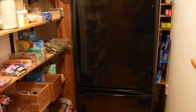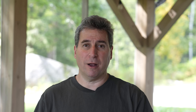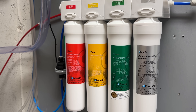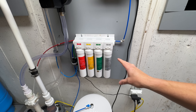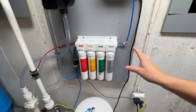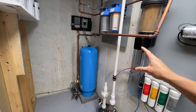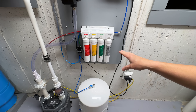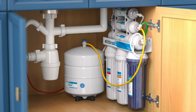But in my case I've got a bigger benefit — I've got two different refrigerators, each with an ice maker, and one with a water dispenser too. If I was buying those manufacturer filters, I'd be spending about $250 every single year for poorly filtered water. Now I've got one system plumbed into both units and I'm getting better filtered water delivered to both. The filter system itself is this white tank — this one's made by Watts, but you can get any reverse osmosis system you want. There's nothing sponsored in this video. You simply plumb water in and out; it's straightforward to install.